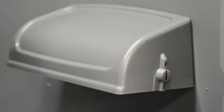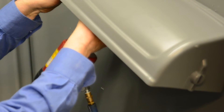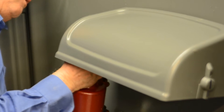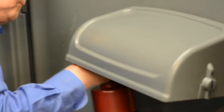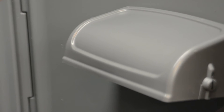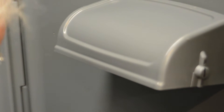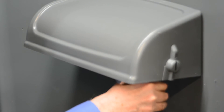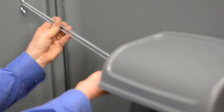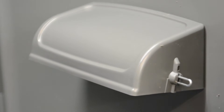Go into that panel, then into the upper left hole. Find the hole, shove it in until you hear it snap into the panel, and pull. Repeat on the bottom two holes — push it in until you hear it snap, then pull. Then put in the paper guard spindle from the back through the slot in the front, and squeeze the tabs together into the back of the unit.